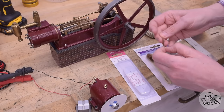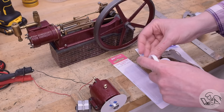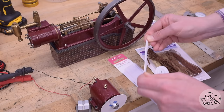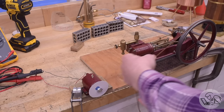There are things I could order online, but I wanted to get something local to try today. The first thing I'm going to try is craft cording — it's an artificial suede. It's got the properties you want in a drive belt: a little bit stretchy but not too stretchy, and it has a grippy surface. Another good candidate is this elastic waistband material used for clothing — it's also got some stretch, it's very strong, and it has a grippy surface especially when stretched to maximum length. I also got some hemp cord because it's very grippy. But let's try the craft cord first — it actually looks like a scale flat leather belt, so that's pretty cool. To join the ends I used super glue.